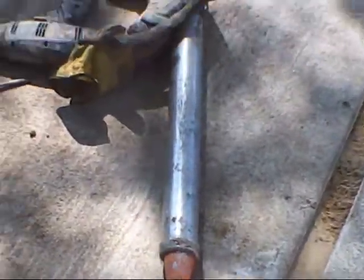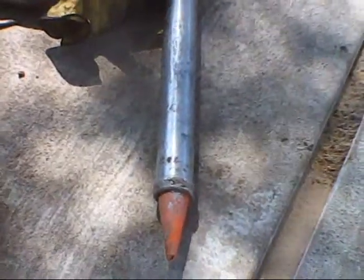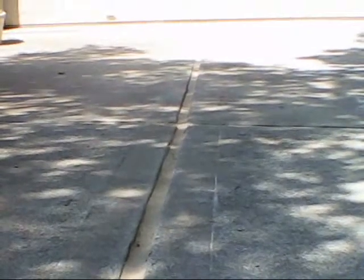You want to feel what I call black holes. Here's a big caulking gun that we use for putting the mastic in, and we can also use ketchup bottles, which I'll be using because it's a smaller job. Now that the dams are in place and the backfill sand is in place, we're just going to go ahead and blow it off so we have all the leaves and debris off the driveway. If you don't do that, they're going to end up in your job.